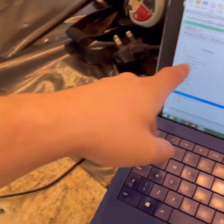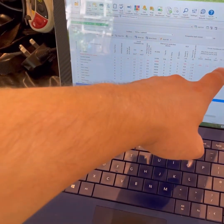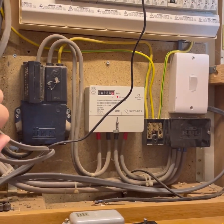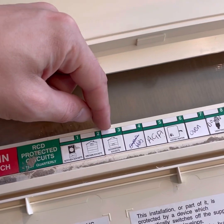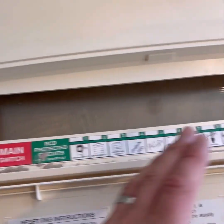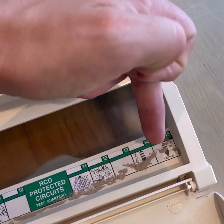First, looking at the kitchen ring final - there's a broken line conductor which obviously resulted in a really high R1+R2, but the insulation resistance was pretty good. As I showed you before, they've loaded up one half of the board - one RCD does so much: upstairs, downstairs, kitchen, oven, hob, Aga. It's just so imbalanced. On this side it's just two lighting circuits.